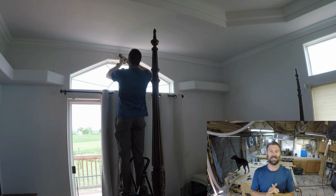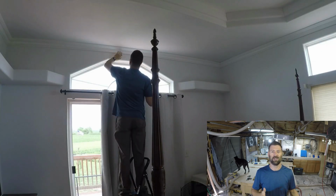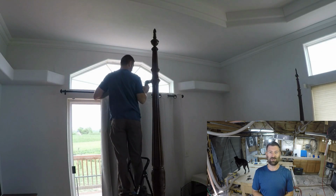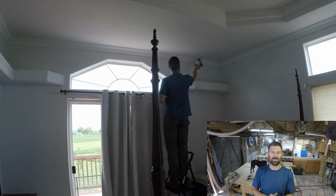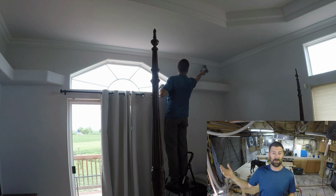You got to do a lot of prep work before you can begin to put paint on the walls. The caulking that I use is called Dynaflex 230. The less expensive stuff won't stretch with expansion and contraction and will crack sooner than a more expensive brand of caulking.